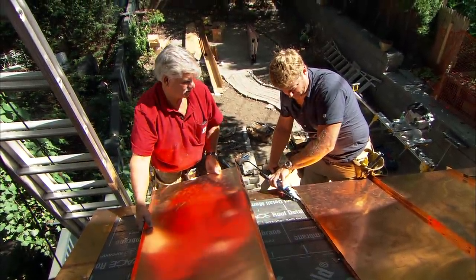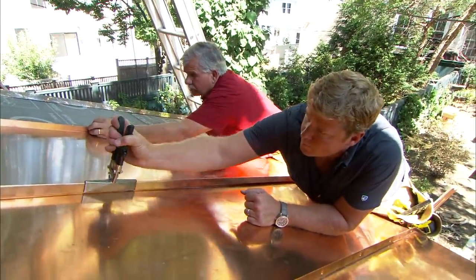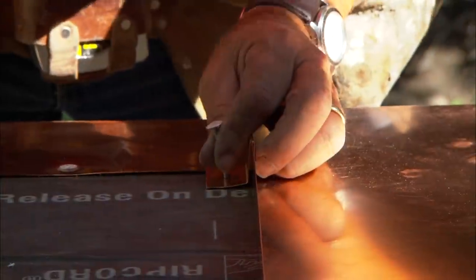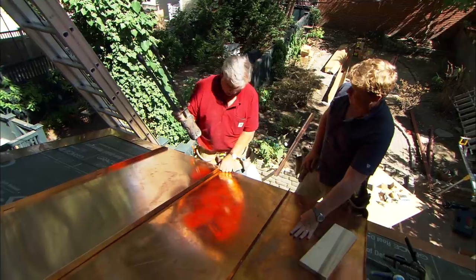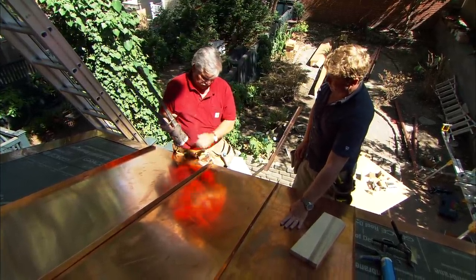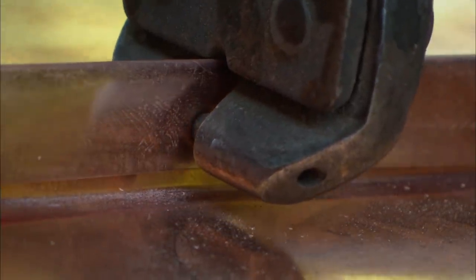To hold the panel to the roof, we're going to run a bead of sealant, push the panel in place, and crimp the joint. We'll hold the other side down with some copper clips and aluminum nails. To hold this side of the panel down I use those clips, but on this side we can't nail into the panel. So what I'm going to do is dimple the two seams together with this little tool right here — that'll keep it from sliding up.